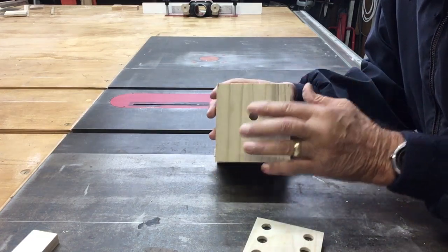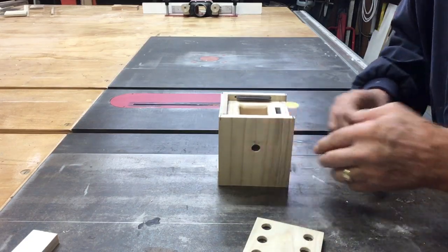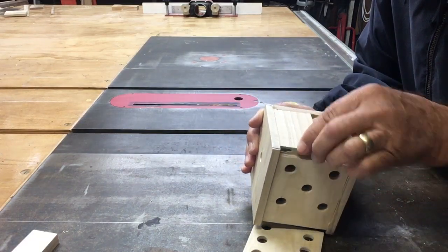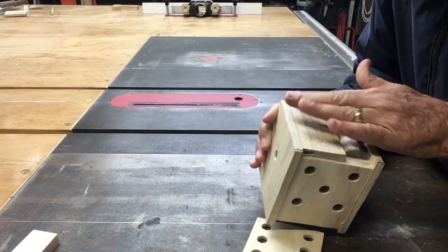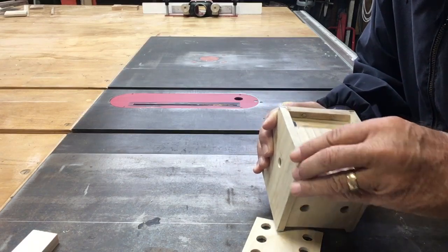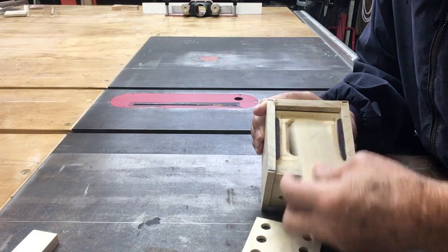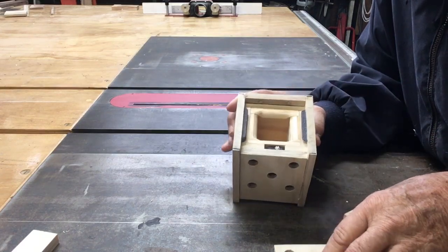So once it's down, put your slide in, put your door on, but use that extra piece that you cut. Remember that short piece? That goes on the slide, like that. And that's what you use to adjust your height of this side, so it's flush with the top. So both tops should be the same distance. You can double check it. That should be the same as this side. And that'll mean that your number 6 top will slide in there easily.